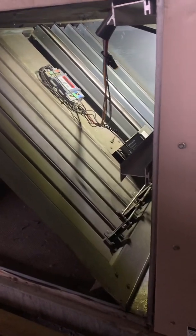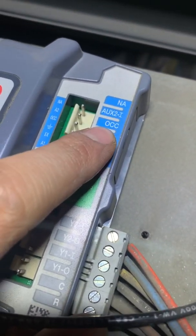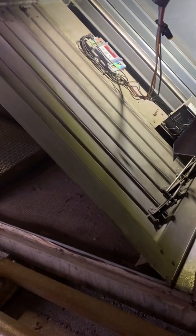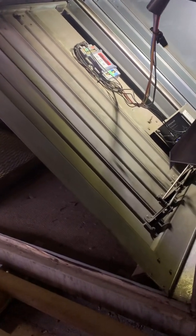If you don't have an occupied wire set up, this is a very common mistake. There's an occupied wire input here, and if you don't have anything wired in, you need to go into the settings and turn occupied to 'always' — so it's always occupied. We never usually wire in the occupied wire; we always just set it to the always set point.